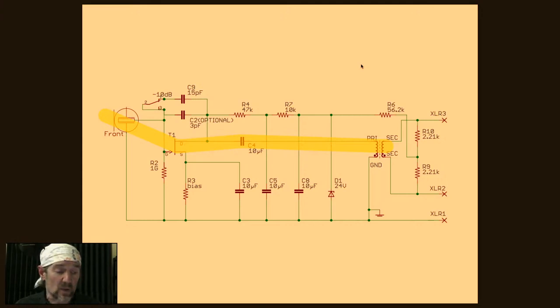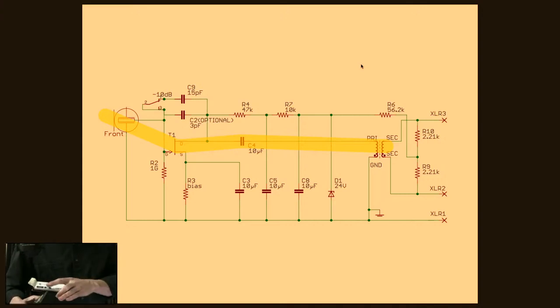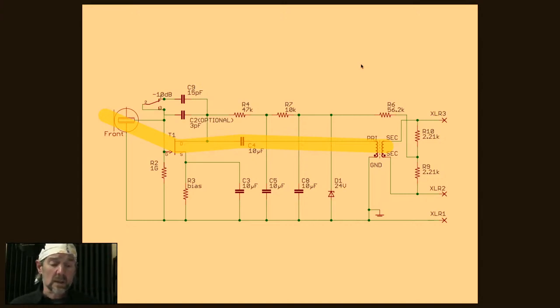We do that with a custom signal injection rig, which is here. So, where is it? There you are. Signal goes in, signal goes out, different modes here, pot on the front. That's what we use to bias JFETs. Basically, it's a microphone in a box, and we're sweeping through different values of this R3 resistor here in order to find where the JFET is operating optimally.